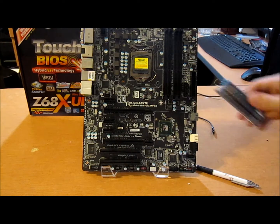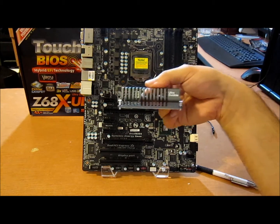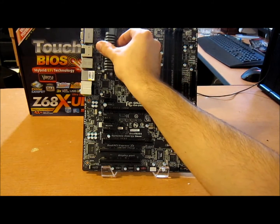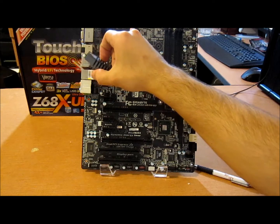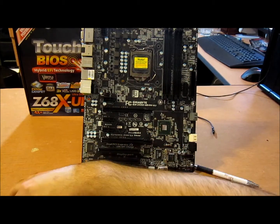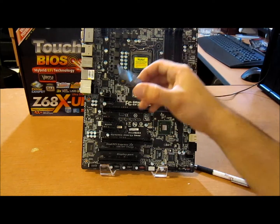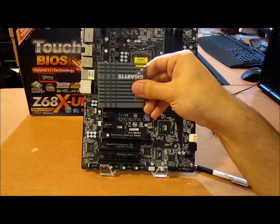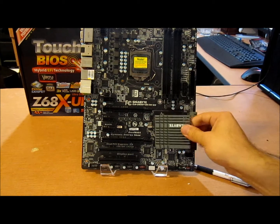Oh, also, one more thing, the heat sinks. Thermal pad here, ultra durable sign here, a lot of heat, but what I don't like is it only covers this half of the board, right? It doesn't cover these two driver MOSFETs up here. Of course, this one's for iGPU, but this one's also for CPU. There is phase dropping on this board, and that's why the LEDs are there. So when not in use, it'll drop off phases. This is the lower heatsink, alright, thermal TIM on it.